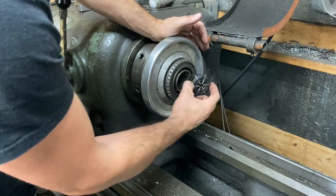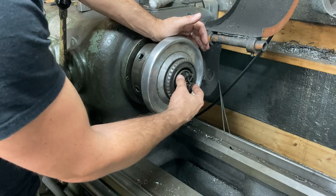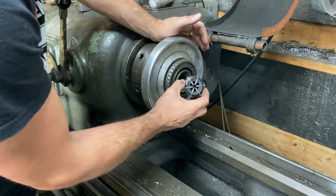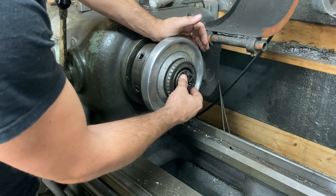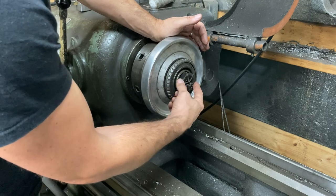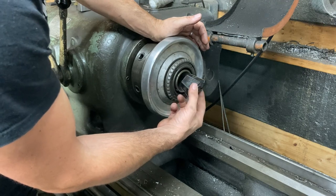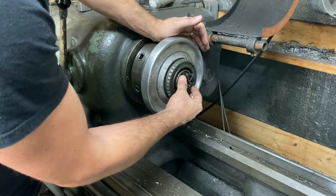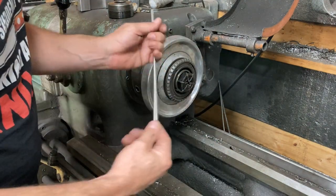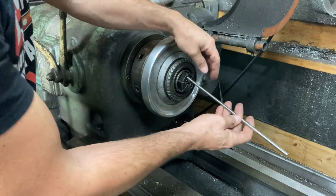These give you very good repeatable tolerance especially compared to a three-jaw chuck. My 10-inch Bison three-jaw won't grip stuff below about a quarter inch very well, but this collet set will allow me to grip stuff down to a sixteenth of an inch. Quarter inch is a very common size to be using in this work.